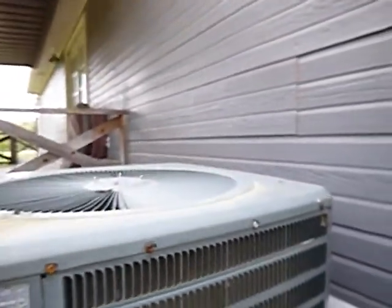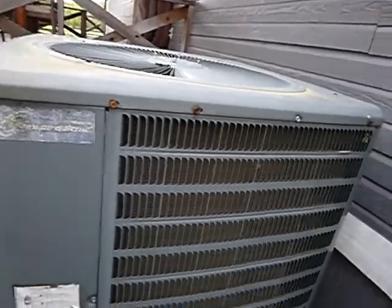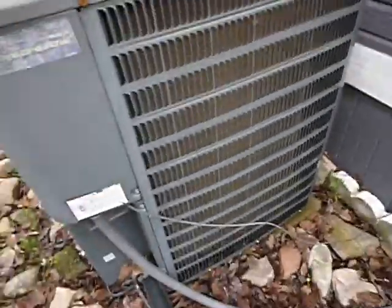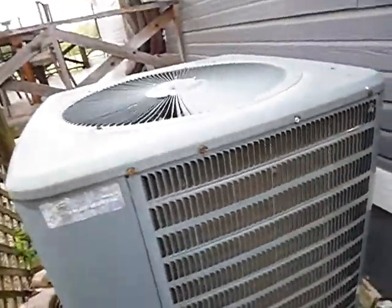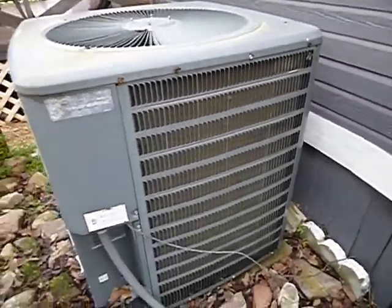Here's your data plate. Once this is all processed, we're going to find out it's 13 SEER, that it's 5 tons, and that it's 13 years old. Now here's the difference: the outside is 5 tons and the inside is 4 tons, so the inside unit and the outside unit may not be matched.